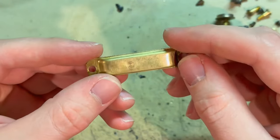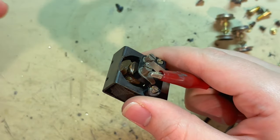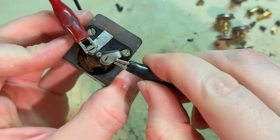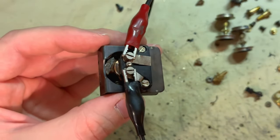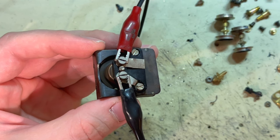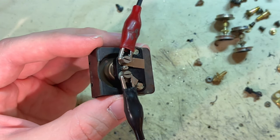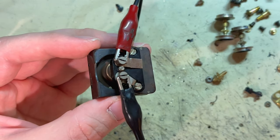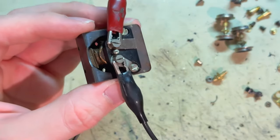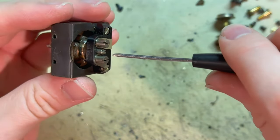That's cleaning up pretty nicely so far. Taking a look at the motor — this brush is positive for forward and the other is negative. Wow, that took right off, no problem. A little noise — that's a really nice running motor. Well balanced, smooth. This does use small bearings, so there's a little bit of noise from that, and of course it's also really dry. Although ball bearings don't really need much oil, it's best to give them a little bit here and there.